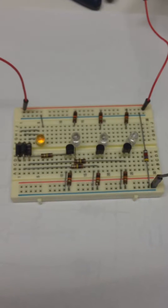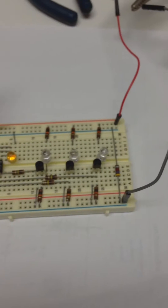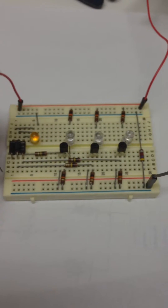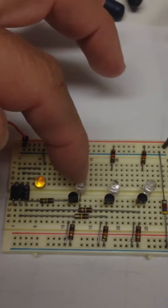Alright, here we go. This simple latching circuit is used to test the sensors and identify which sensor has given us the signal. This will be the input here, coming to 24 volts, and I've got my three sensor indicators — one, two, and three.